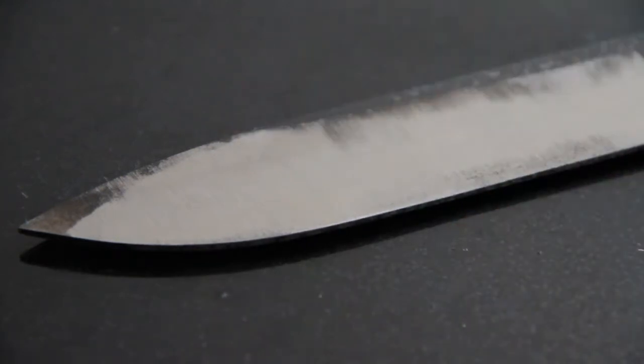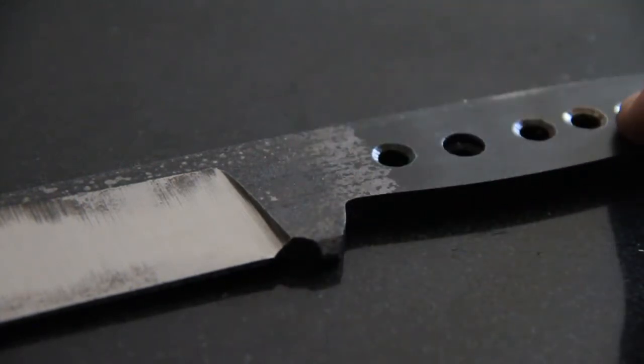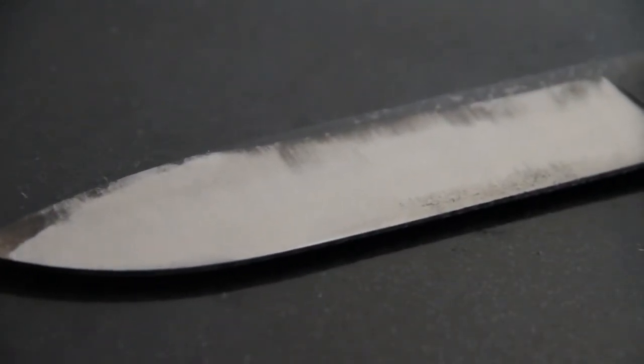Even when I was grinding this, I could feel it was like trying to grind glass, even on a blaze belt. Another good reason to do a bit of grinding and clean up the surface is before you temper. Having a nice, clean, bare steel surface will help you assess the surface colours, and that can only happen when air is able to interact with a clean steel surface. It'll be really hard to do if it's like the handle here — you can't see any of the colours at all. So before I put them in the kitchen oven, I always clean them up like that.